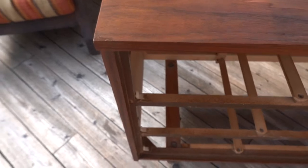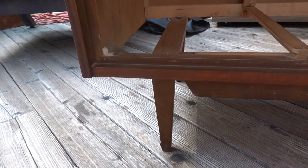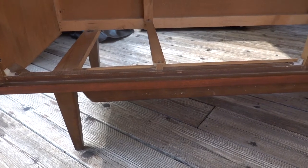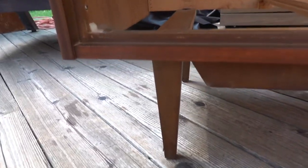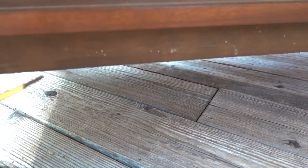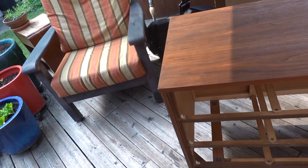This is what we ended up with — I think the color is pretty good. I also went along the bottom and filled in that bar down there because that wasn't walnut veneer, and when I sanded it down it was really white so it wasn't the same color as the rest of the wood. I went over it with the colors I was using to fill — it's a little on the red side but you're not really going to see it because the drawers sit on it. I also touched up the bottom bar with a dark brown color for the white nicks along the bottom, and touched up the legs. This corner is really matching though — I'm really happy with how it turned out.